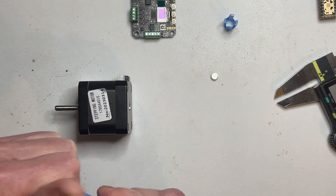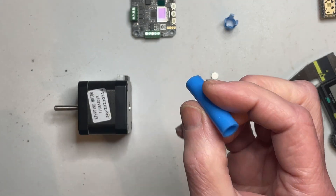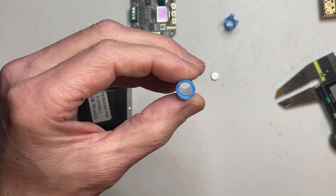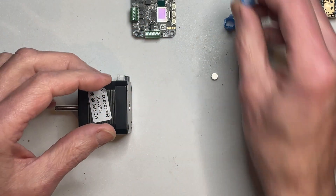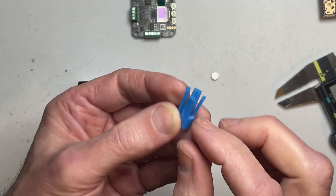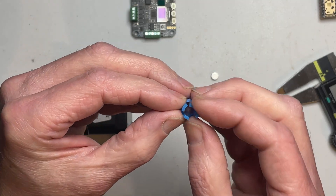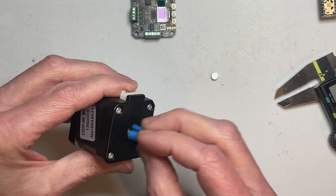I've got some bits of pneumatic tube with a 10mm outside diameter and a 7mm bore — it's 1.5mm wall thickness. It's too big, but if you cut it at 90 degrees then 45 degrees, and then cut alternate pieces out to make fingers, that gives a flexible reducer that takes it from 9mm down to 6mm.